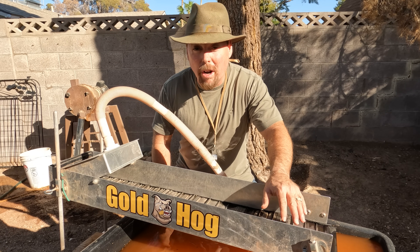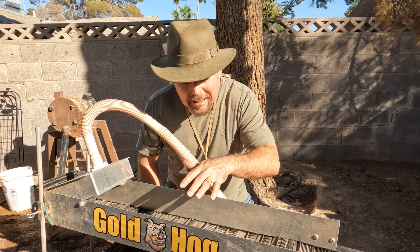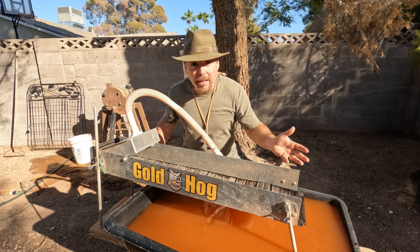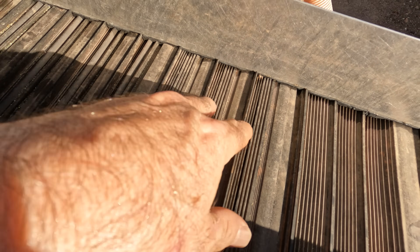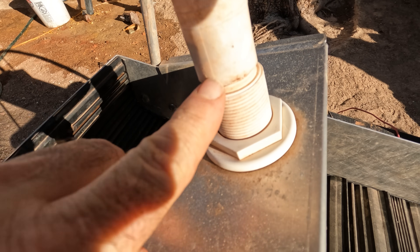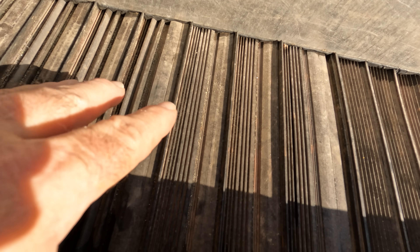Now that you've got all your sulfides crushed down, you've got to get the sulfides away from the magnetite and any other material trapped in there. I like using these Gold Hog multi-sluices. These are fantastic because they have two different ways of cleaning your concentrates — you get a primary mat, a scrubber mat, and a little reducer that goes in to slow the water down. This thing will literally clean up all of your concentrates. I decrease the amount of pitch on this sluice box because sulfides are relatively light and they'll float away.